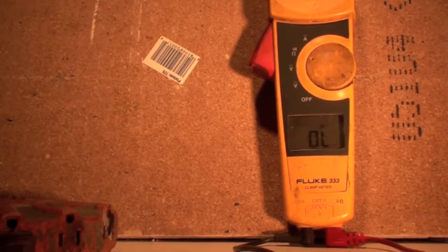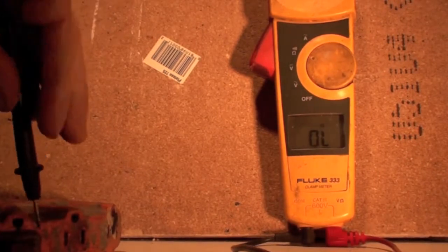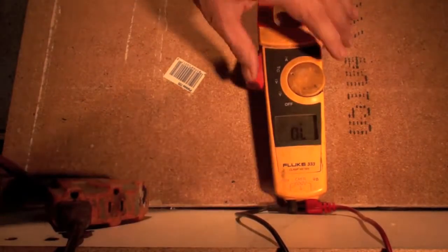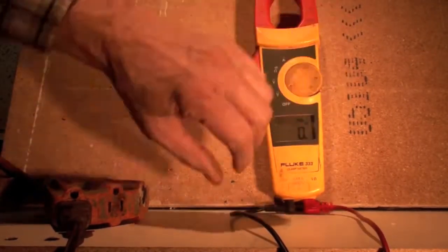And I'm going to be checking the power at this outlet. Now, if I put the probes across this plug, it's a little easier. Now you see it kind of got mad at me because I'm in the ohms position and I should not be checking volts with it. The older meters, if I did this, it would either have blown a fuse or killed the meter. Okay, so these meters kind of protect you from yourself so you don't destroy the meter when you make a mistake.